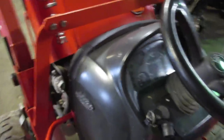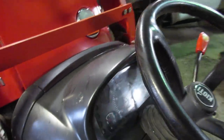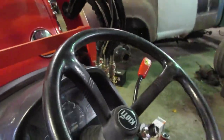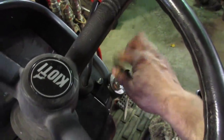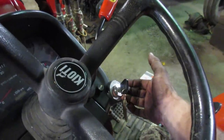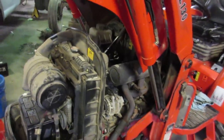The dash layout has a couple of known issues. The engine sometimes won't shut off — that's caused by a timer relay underneath the dash. There's also a glow plug timer that sometimes doesn't turn off, though it's working correctly right now. Before replacing either of those — they're about $60–$100 US from the dealer — check the key switch first, which is also around $100. Try spraying it with lubricant and applying dielectric grease on the back contacts and on the glow plug timer and engine timer plugs.